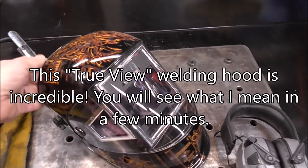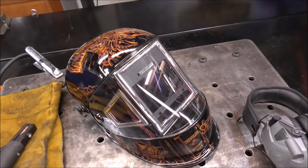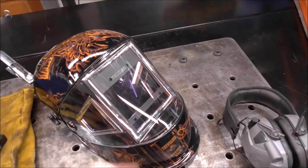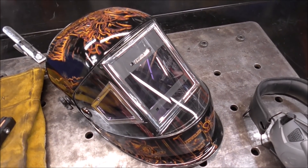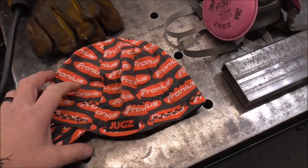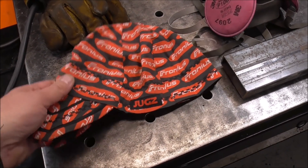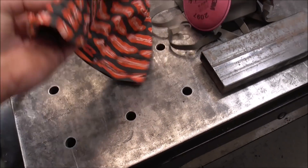You're going to want a good hood — any brand. One thing a lot of welders avoid, especially newer welders, is keeping up on their shields. You want to clean the lens regularly using a microfiber cloth wet with water. Don't let it get caked up because vision is really important when welding. Make sure you replace lenses when they wear out. A welding cap is great — it works well when welding overhead and helps keep metal filings out of your hair, which also prevents eye injuries. The bill on a welding cap is worn on the back to shield your neck from spatter.